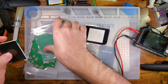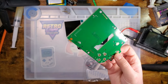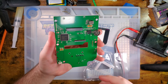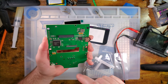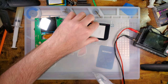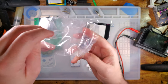So this is what you get: you get the adapter board that connects to the DMG — it has all the button inputs, unlike some previous versions of original Gameboy kits. This is the button board and it is the backlight kit, so you're not plugging anything else into this. You just plug the screen in here and then plug this end into the DMG, and the speaker in here. You also get the screen, a lens that looks to be stock sized, a bracket for holding the screen in, the ribbon cable for connecting the button board to the DMG, and the speaker itself.